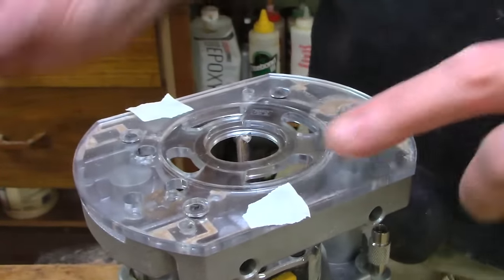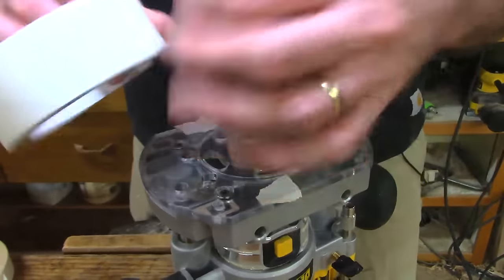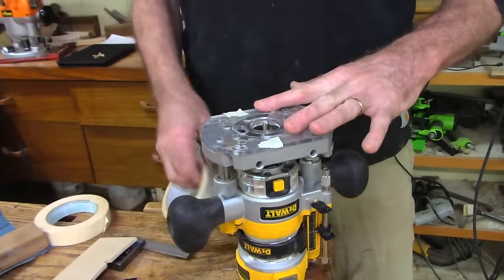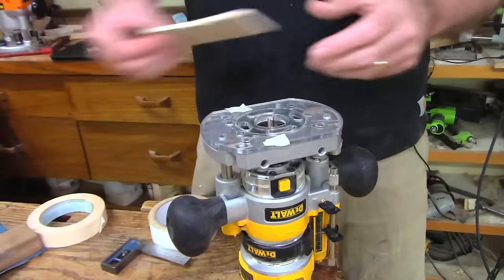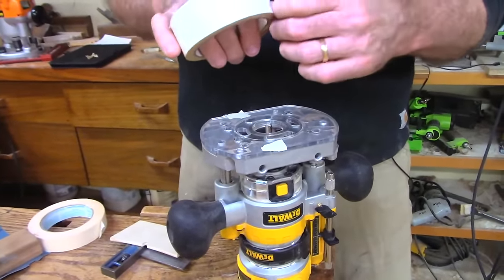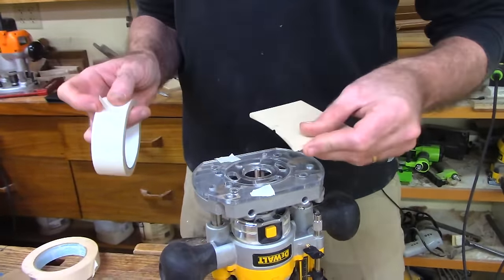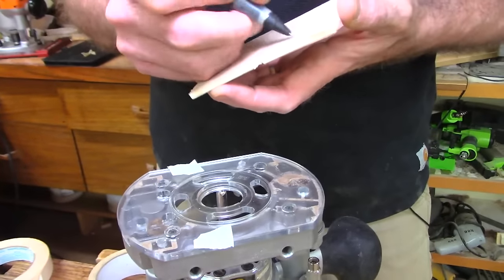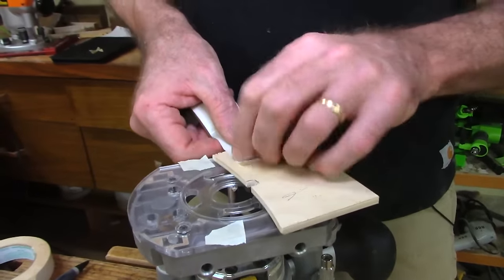Now here's something that's a great asset in the shop, and that is double stick tape. So use this a lot in cases where you just want to temporarily hold something on the base. You can't really clamp it. It's not worth screwing it on there. And this carpet tape works amazingly well for holding anything on that you just need a temporary good hold to. So we're just going to take our template. So this is definitely the side I want to put the tape on. And let's just put a little piece right here